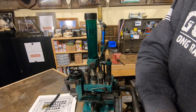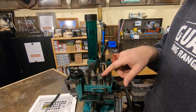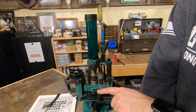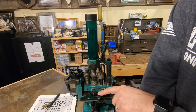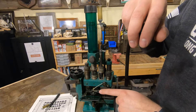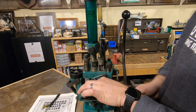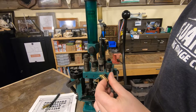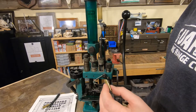I need to reactivate the powder measure by pushing the pins back in. This powder measure is not case-activated — whether or not you have a case in there, if the pins are engaged it's going to dump powder. That's a quirk that makes this more complicated and leads to errors. Cycling the handle engages the powder measure — you can see it rotate halfway and then engage the second pin to rotate all the rest of the way. At station two I'm flaring the case, which would dump the powder. Unfortunately I've already mangled a case — we're off to a great start on how well the Green Machine works.